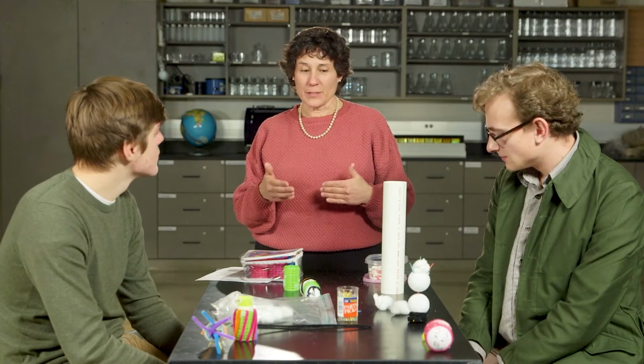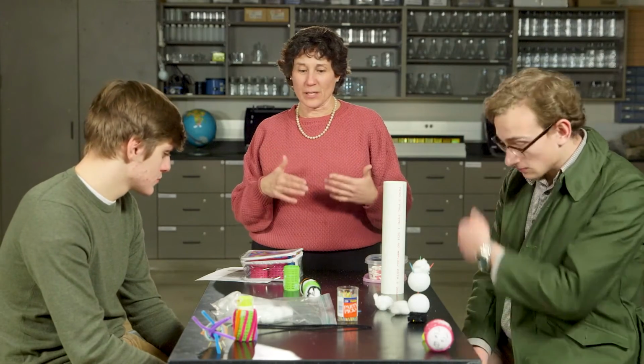So there might be some potential problems with running a pig through a line, and we ran into one when we did Adam's. Sometimes they can get stuck. Sometimes there's a lot of debris that needs to be cleared out before the pig can actually be removed. Oftentimes the video feeds are very helpful in telling where there might be leaks or where there might be some potential problems that need to be cleaned up with a different type of instrument the next time.